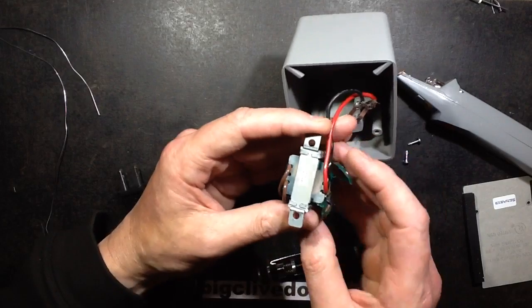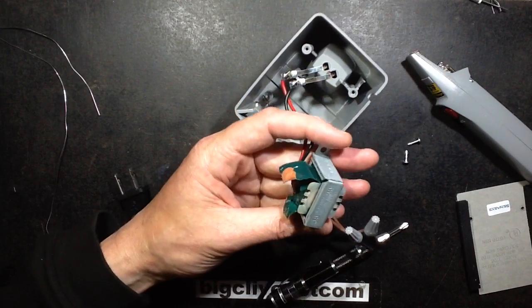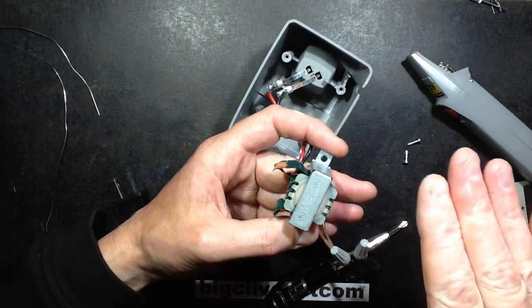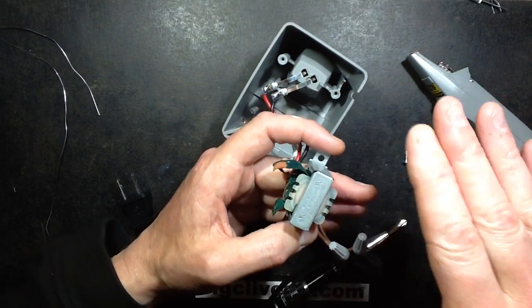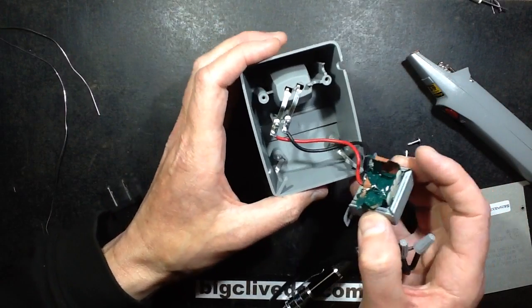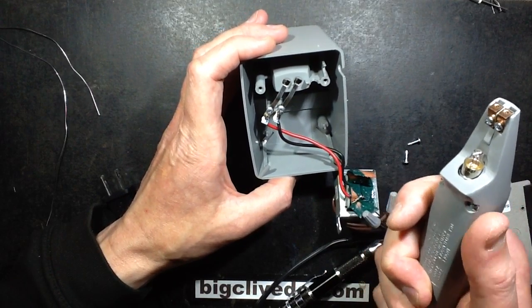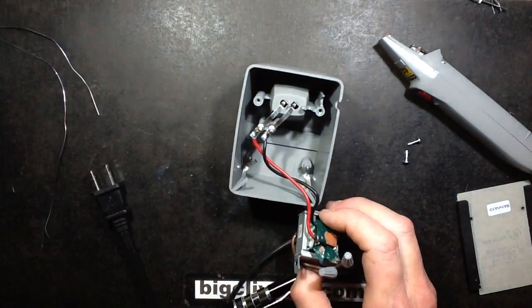And that's all that's really needed, because with these small transformers, they have what's called a fairly high regulation, which means that the voltage floats up quite high, but when you load them down, as the current goes up, the voltage progressively goes down. So basically, they've chosen the transformer to deliver the charging current via that diode that matches the 2.4 volts of these cells. So yes, I'm going to modify this now.